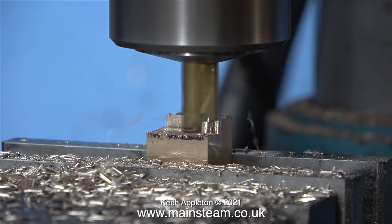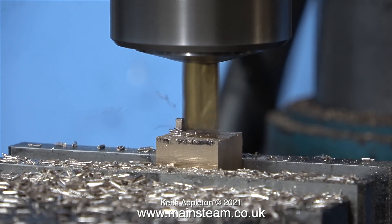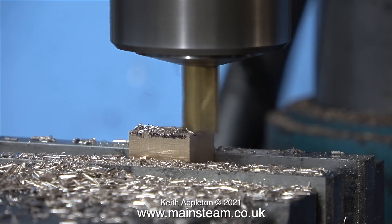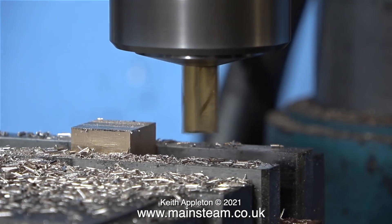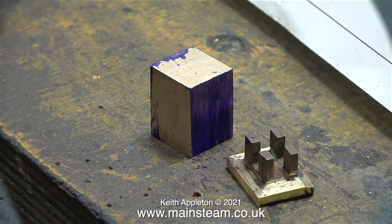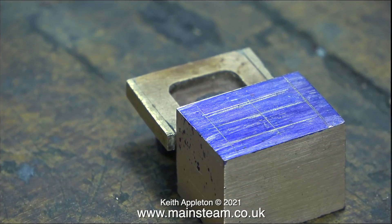By using a series of rough cuts followed by finer cuts I'm reducing the block to the size I need it to be. Because the block is now square I can hold it quite securely in the machine vice, and now you can see that using a sharp cutter it's perfectly acceptable to use a longitudinal traverse. Here's a shot of the block sat next to the old valve that I made — the old valve was very experimental, mainly because I didn't have the right size cutter, but now I do so I can make a proper one this time.